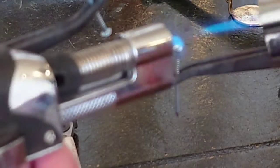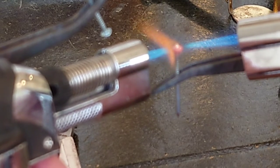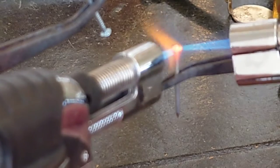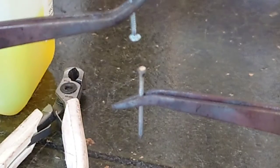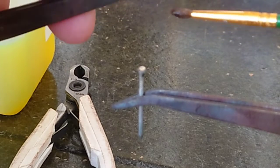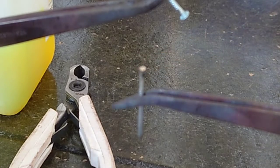I'm about to use a couple of blowtorches. I'm going to heat the head of this nail up until it goes red hot, the solder beads, and it melts flat. We've got it partially melted there. Once that's cooled down a bit we can do more. I'm going to put some flux on the nail head that's going to be joined, and maybe a tad more flux — I've had to wait till it cools to room temperature or I'd burn the brush.